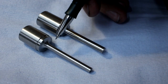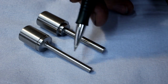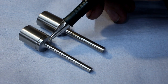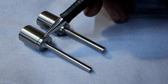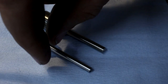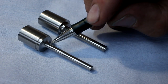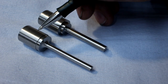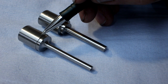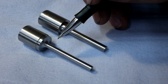Welcome back to this old tabletop. I have to turn a bunch of these parts. They are way more complicated than this, but this end looks like an automotive valve. It has a long slender diameter, a blend face, then a diameter here. This looks reasonably simple, but the diameter needs to be quite parallel, the radius blend needs to be at least perfect, same for the radius blend into the face. And to top it all off, it's 14401 stainless steel — that's 316 stainless. It machines reasonably nicely and leaves a beautiful finish, but it's quite hard on tools.